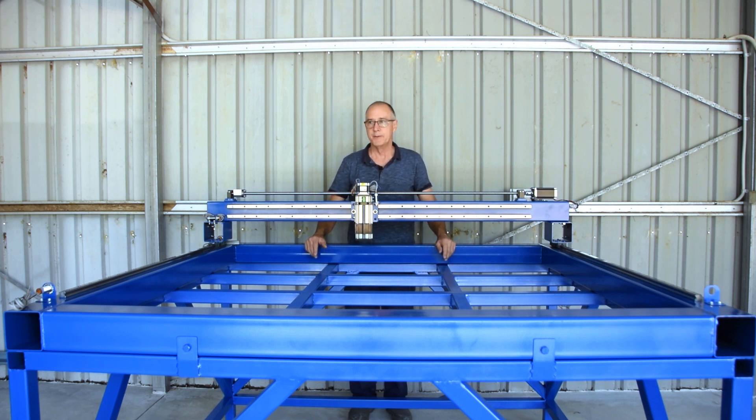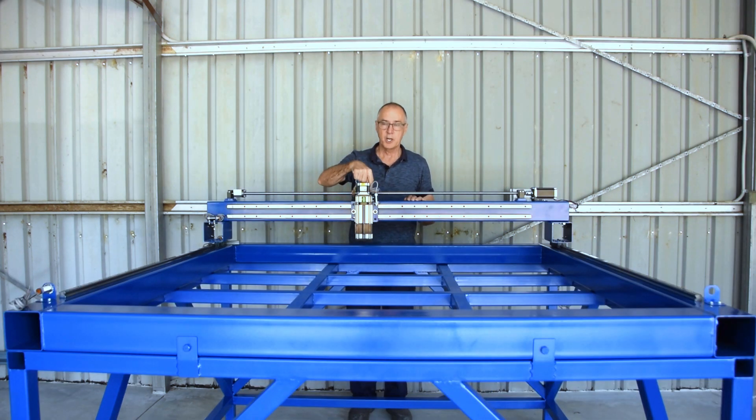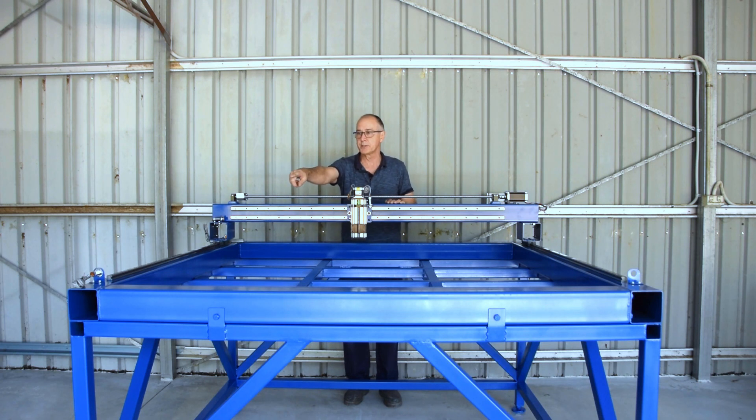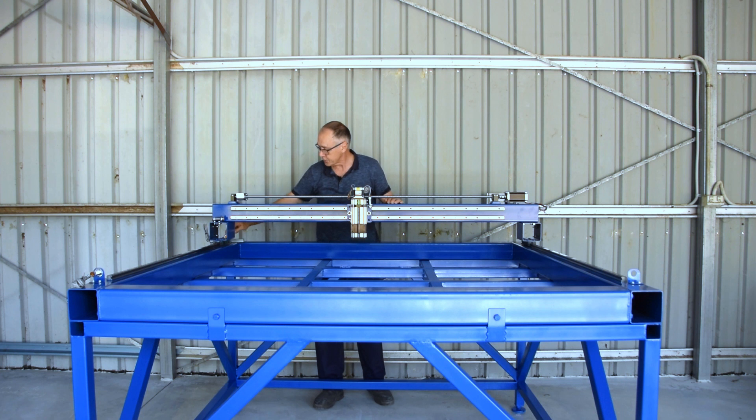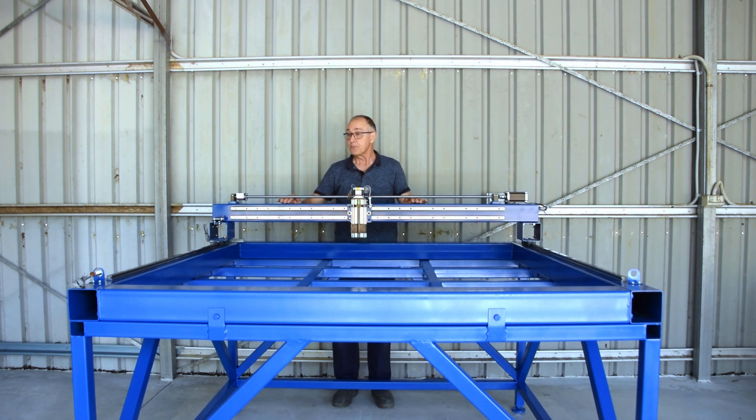This thing is not going to go anywhere, and I'm confident it'll be as sturdy as I can get it. That wraps up part four of how to build a CNC plasma cutting table — I'm really pleased with the way it's come together. In the next video, we need to wire up the homing switches, the over-travel switches, and also the stepper motors for the X, Y, and Z axes. There are homing switches on the front corner and for the X, and over-travel switches on the back. We should get to a point where we can make test runs and have the software driving the torch and the whole bed assembly under its own steam, driving it around the table.